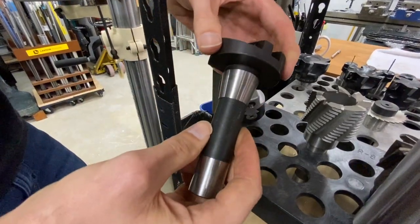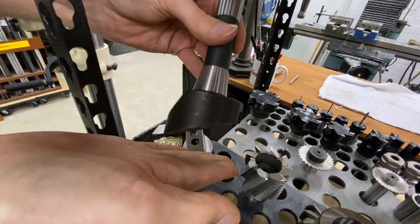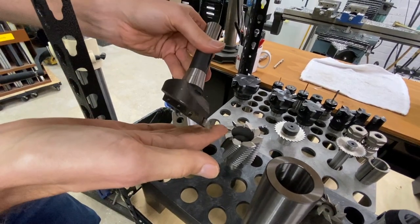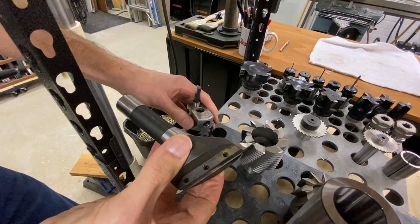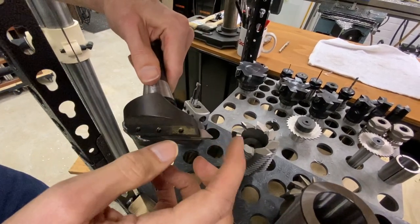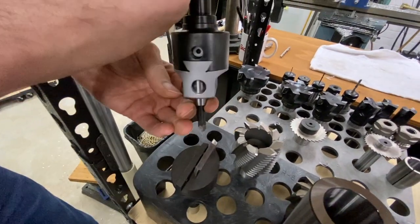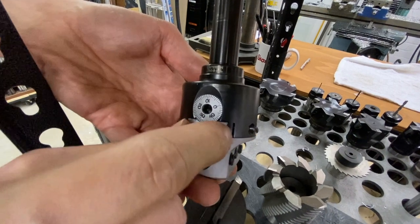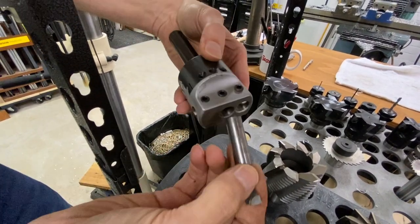As far as other more unusual integral shank tools, there are fly cutters like this one. It has a fly cutting head on it with the shank — it's like an old-school face mill. Still really good for a really fine finish on material where you're going to take just a little bit off to make it super flat. Single point, so it's a little bit slower feed, but still worth having. For 20 or 30 bucks it's very worth having in the shop, because you may need to set up a specific diameter to cut a very specific radius, and that's one of the things this holder is really good for. Then there are boring bars also. This one you can use to cut very precise holes — rough it out some other way and do the finish cut with this, and it's adjustable in diameter by a thousandth of an inch. It moves a dovetail in and out to set your diameter and will mount tools in two directions — large holes by the side mount and small holes by the tip.